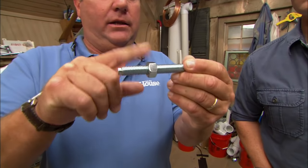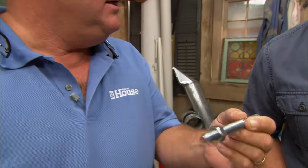It's a machine thread — a straight thread. Most nuts and bolts have it, and you can make that nut go up and down because this is straight. This is not the type of thread we use normally in plumbing. We use one called a tapered thread.